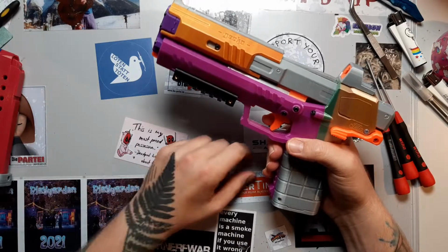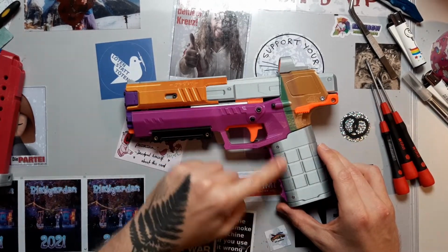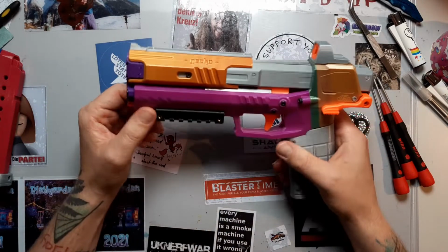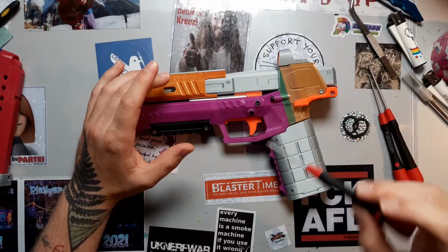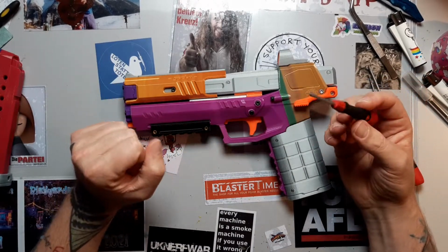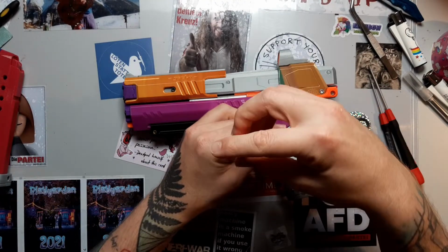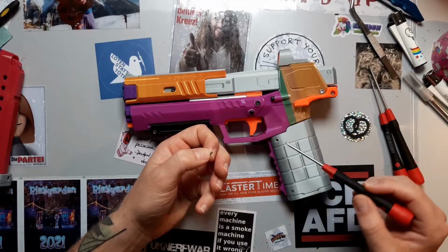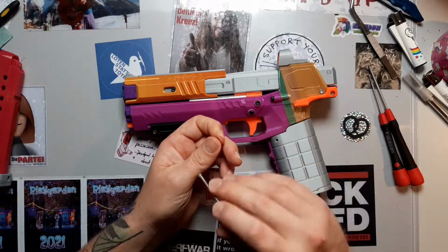First thing. Done. So, all the little screws, the M2 screws, the ones in the handle, the ones up the top here, the ones here, they are screwed directly into plastic. And as I said in my assembly video, do not over tighten those, they just need to be tight. It's the same thing when you take them out. You just want to unscrew them until they're loose, and don't overdo it, because you want to keep this top thread. So right now, I've just taken this little screw out, and when I put this back together,